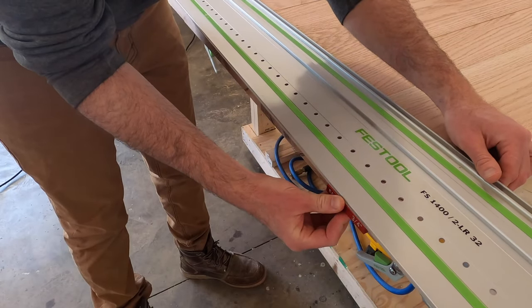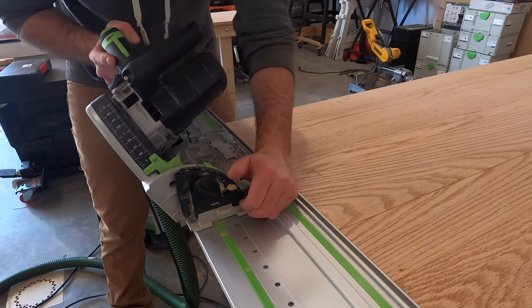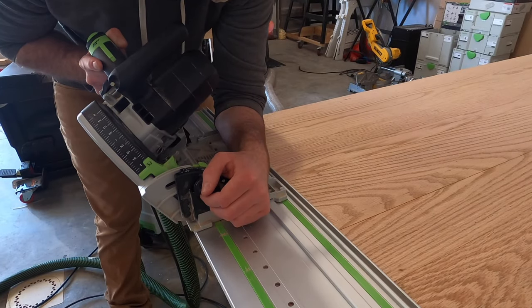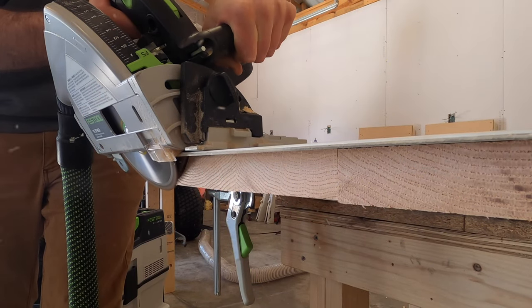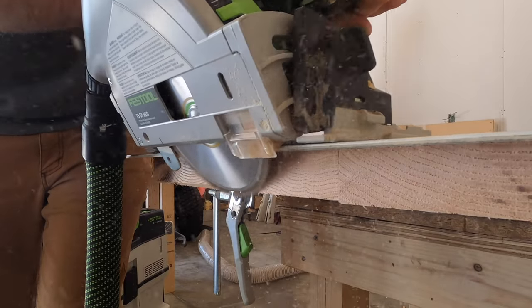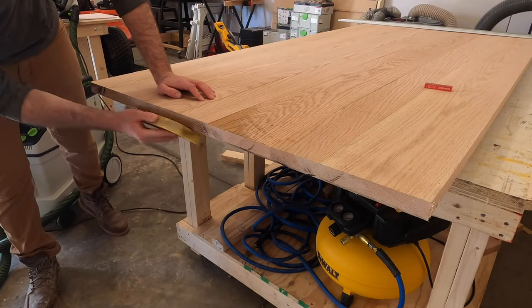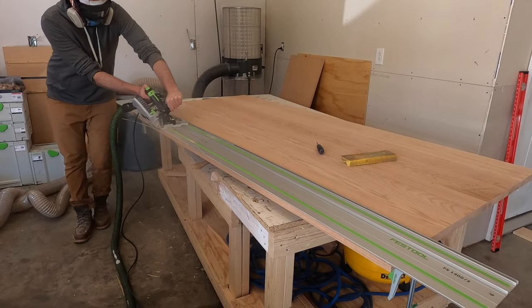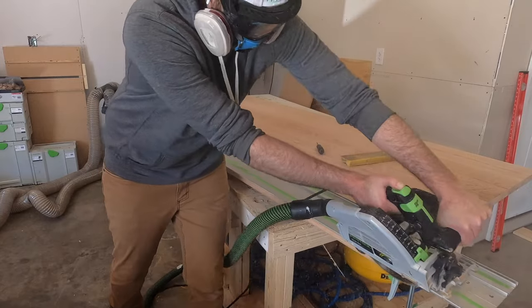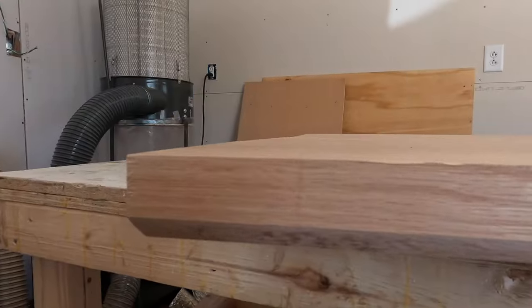Perfect example of an issue as to why you want to leave a little bit more dimension than you're working with, because you can always take it down but you can't add more. Rather than put a round over or a chamfer on the top of the table like I normally do, I decided to put a chamfer on the bottom side. I used that setup lock to offset the end of the track about three quarter inches off from the edge of the table, which would push the track saw out a little bit and leave part of the edge of the table flat but also put an angle on the underside — which I find to be super cool and a really unique element of detail whenever you're looking at the table top.